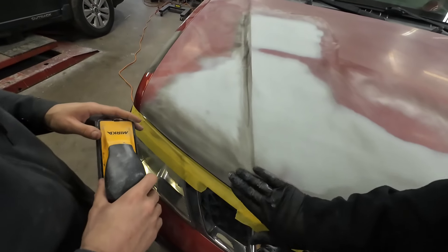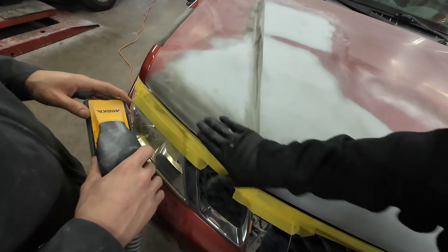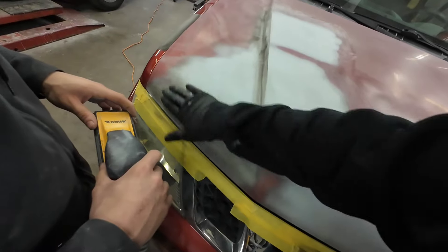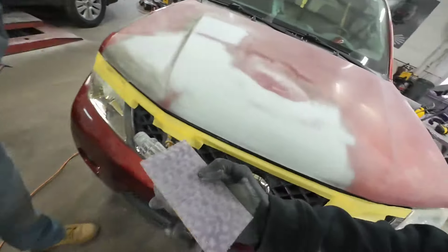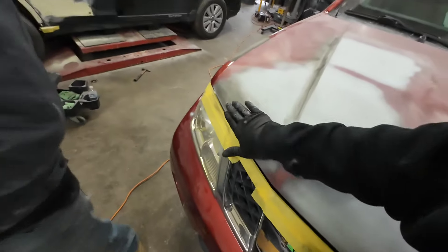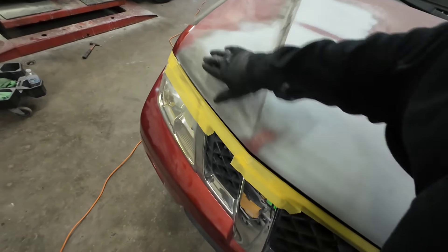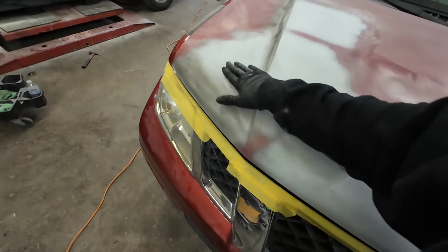This section is a little bit tricky because it not only rolls this way but also rolls this way, so it's not perfectly flat. Maybe a smaller block might work a little bit better. Let's put some 320 on that smaller block — it's not going to teeter or roll. You'll be able to do a smaller section and then just work your way over.